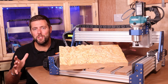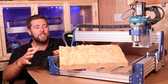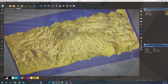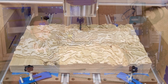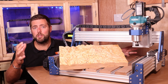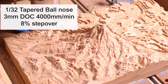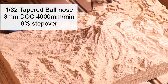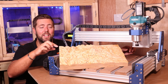Every time I do a review I like to do something different, and after moving on from the 400 watt spindle to the Makita, I decided to do this 3D relief carving topographical map of Mount Rainier. I'd never done one of these before — it was originally 85 millimeters deep. I had the finishing pass running at 4,000 millimeters per minute to test the speed on an endurance job, and it came out absolutely brilliantly. The roughing pass was three hours; for some reason the finishing pass took nine hours versus a simulation that was only five hours — I need to understand that discrepancy. The step over was eight percent and the detail is brilliant.